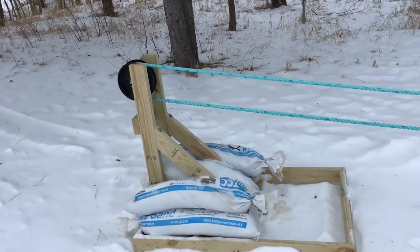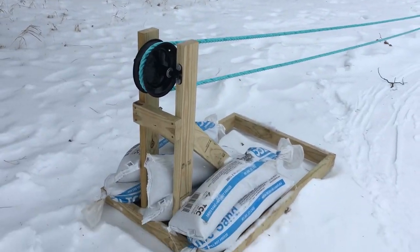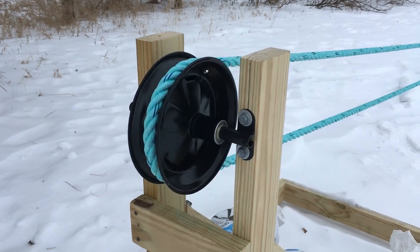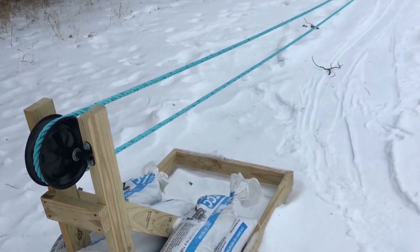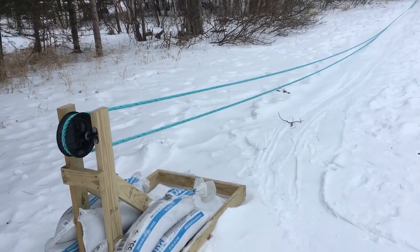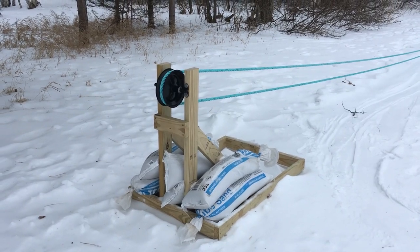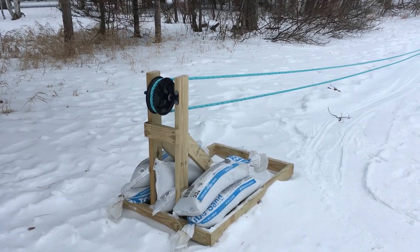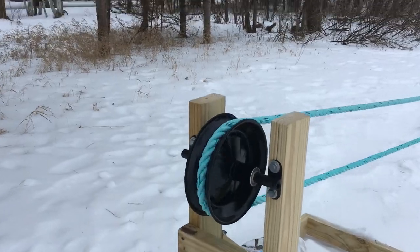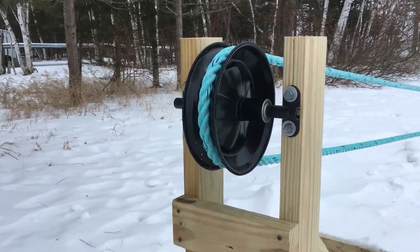Here's the idler — the bottom portion of the tow rope. Really simple, it's just a wooden frame with the same wheelbarrow rim setup. I weighed it down with some sandbags — there's really not a whole lot of tension on it, you don't need much. I think these sandbags are 60 pounds each, six of them, so 360 pounds. Here's the splice coming through — you can see how it just goes right around. Works really good, nice and quiet.